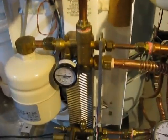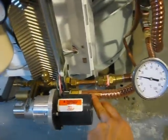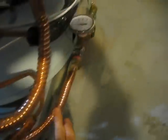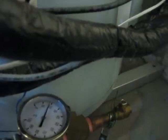Now how does it get down into the tank? Well, if hot water is rising up, then nature abhors a vacuum, so it's going to pull in cold water, and that cold water is going to be pulled in through this pipe back here, which is connected to the bottom of the tank, and it just goes into the bottom of the tank right in here. There we go. And that cold water that's being pulled in is just coming from the tank.